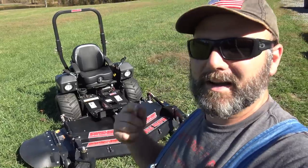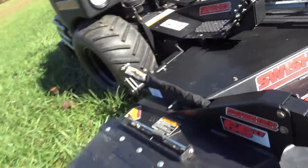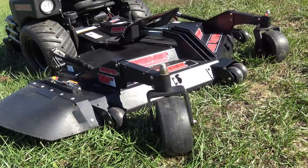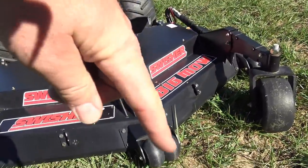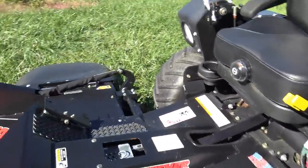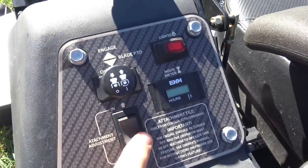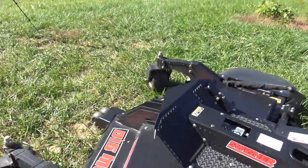It's got an awesome seat on it. Starting with the deck: the discharge chute is a really heavy duty, thick guard. I don't really like running a guard but it's a little windy today so we'll leave it down so I don't have to wear the grass. We have anti-scalping wheels all the way around — one on each side and two in the middle. The deck is fully adjustable and electronically adjusted. You have a foot pedal that brings your deck up or down, or a switch that does the same, all actuated with a little winch system with a belt.